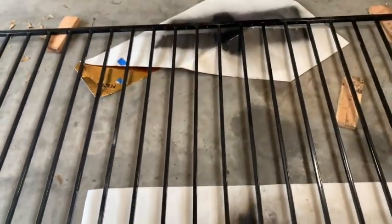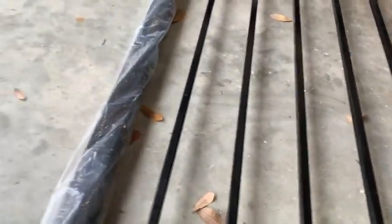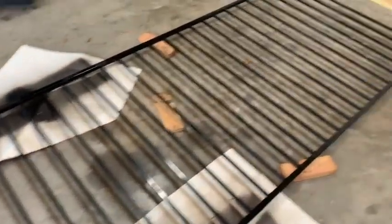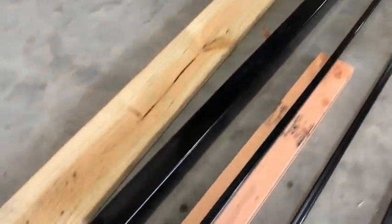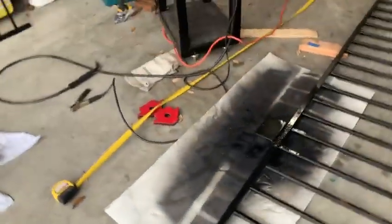Keep in mind I'm an amateur, but I can dirt-dab with the best of them. Did the same thing on this side, shot it with a little Rust-Oleum paint, gonna let that dry, then flip this thing over and move to the next step — which is welding the fancy end pieces on to give the gate a little more substance and make it look more attractive. Plus we'll put a piece of angle iron where we can attach our chain to actually open and close the gate with the gate opener. On one end, you can see we welded the corners on — this will have a nice little end cap on it. Walking down the middle you can see the middle splice.